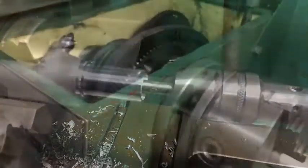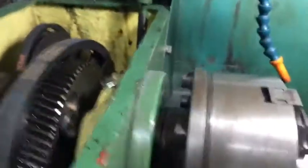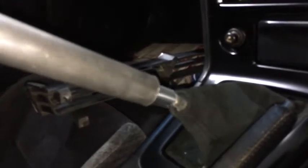Just wind that out. One thing I forgot to mention: when you're tapping on a lathe, you've got to lock the spindle, otherwise it'll spin. It locks it in place - I always leave that up when it's locked, so I'd never try and start it when it's locked and stuff it up. Okay, see if it fits. There she goes - it'll wind down 20mm, it'll cover all that ugly there.